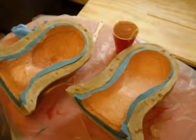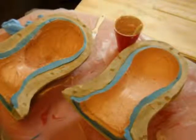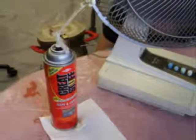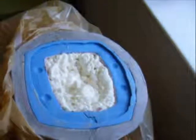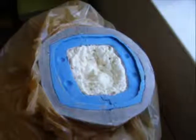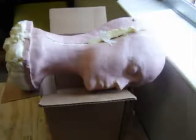We had a little idea: brush in some Bondo to make a nice layer for a new foam core, using Great Stuff foam because it was cheap and available. We put the two sides of the Bondo'd mold together and sprayed in Great Stuff. This turned out to not work quite so well — foam escaped from the seam, and some foam that never really set up inside continued to escape and create little projections from the seams for several days, generally just widening the whole thing.